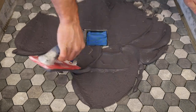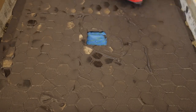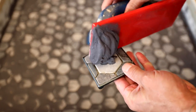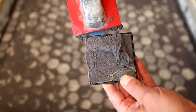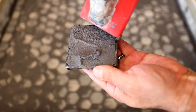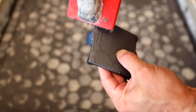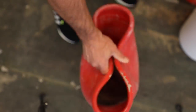Now that the tile is set, it's time to go home for the day, come back tomorrow and get it grouted. The grout I'm using here is Custom's Prism Grout. This is a high-performance grout similar to Mapei Ultracolor FA. It can be used on grout joints from 1/16 to a half inch and has really good color consistency, and no sealer is required. The problem with these high-performance grouts is that they can become soft, especially when wet, and the grout can be scraped out fairly easily. If you'd like to see a video I did on testing different grouts, I'll include that link in the description below. While I wait for the grout to set up for about 30 minutes, I clean up.